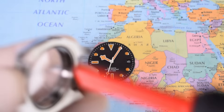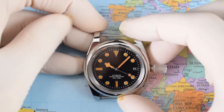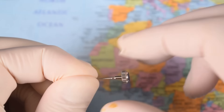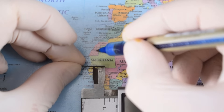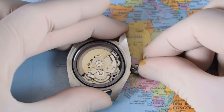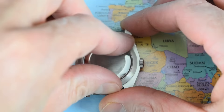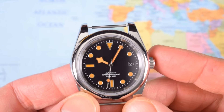Next up I need to trim the crown stem and fit it to the crown that comes with the case. The plastic tip one from the new movement is a placeholder — it's too short and no good. I put the stem back in, screwed it on finger-tight, and there's far too much space — about 8mm too much stem. I took the crown stem back out, marked it at about 7mm, then clipped it, giving myself a bit of margin for error. Better to make two clips than one clip too far and waste your first stem. I did play it a little safe and had to retrim another millimetre off; second time around it worked perfectly. I was able to screw down the crown and all functions of the movement still worked. I also used a little bit of Loctite thread locker to ensure the crown stays attached to the crown stem.